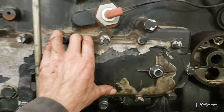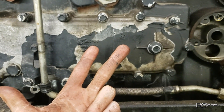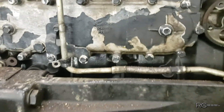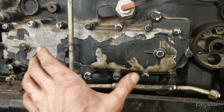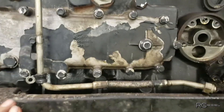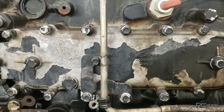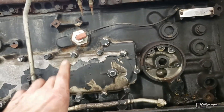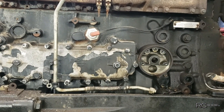So I put a brand new cooler in - tightened everything up with new o-rings, new cooler, all that good stuff. The reason I put a new cooler was because I think it's leaking and there's no way to clean that stuff out of those cores. I checked with the dealer and they said yeah, every one of their stores has sold them, so it is a problem area. I went ahead and replaced it with new seals and everything, then filled it full of water and pressure tested the cooling system. It took about five or six minutes but then it just started to run water out of the oil drain again - so unfortunately that did not fix the problem. It may be part of the problem, but it is not the reason we're getting water into the engine oil. That's where we're actually going to need to pull this motor out and find out what's actually happening inside.